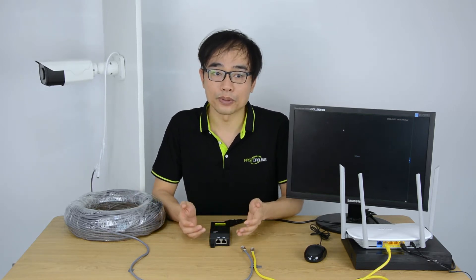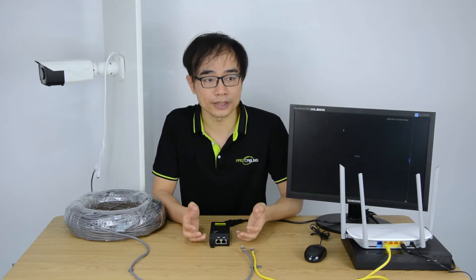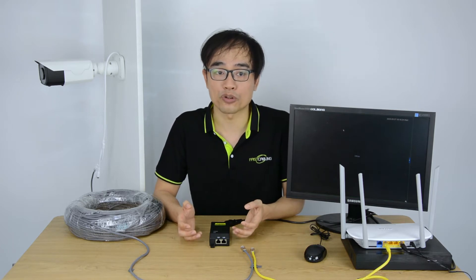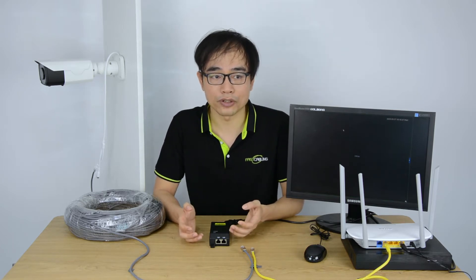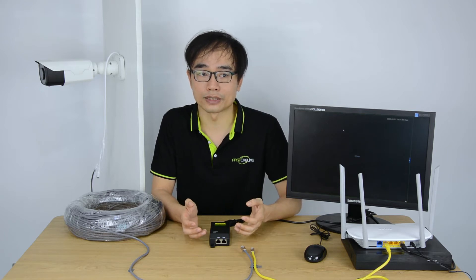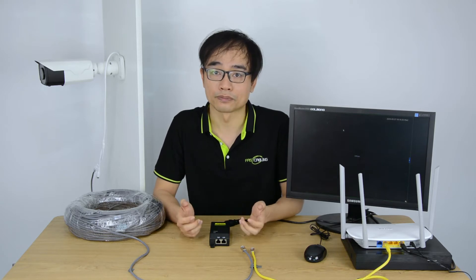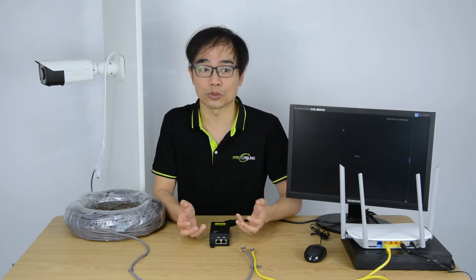You can even use pre-made internet cable. It's important to pick the internet cable made of pure copper. The reason is because low-quality cable could cause serious power loss, especially when you are going to hit the 100-meter limit distance of the PoE. According to our experience, that's the primary issue why PoE doesn't work correctly.